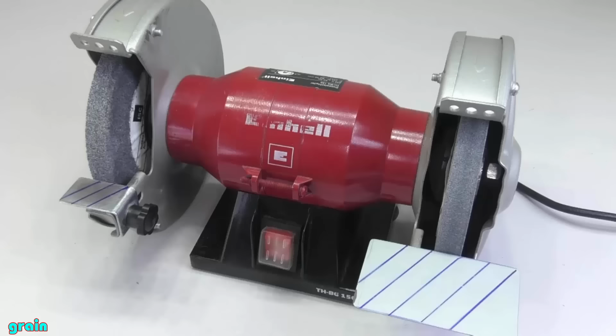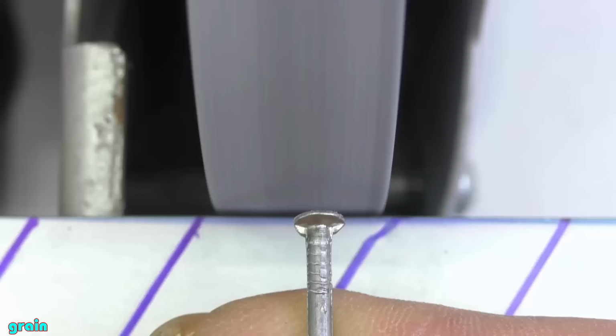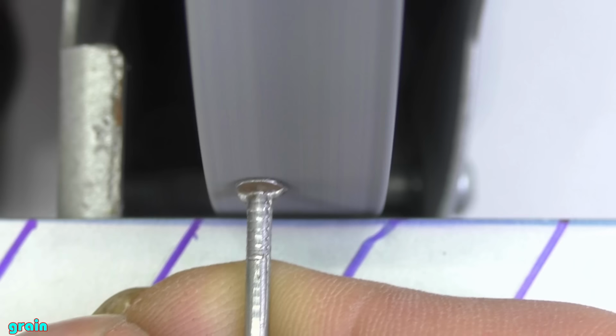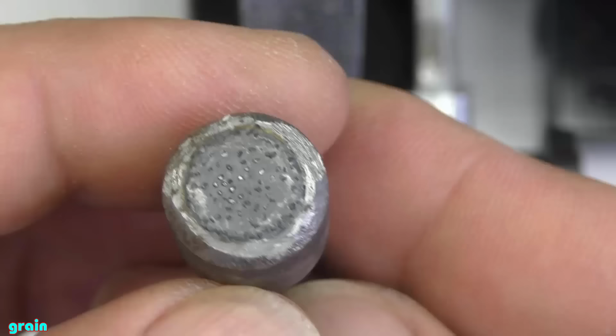First of all, you need to set up your grinding machine. I have to make a separate video for this, but I will say only the main thing. The grinding wheel should not have radial and end vibrations. You can level the grinding surface of stones with a special diamond pencil.